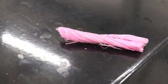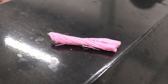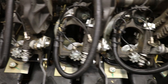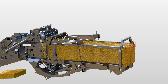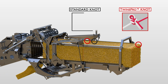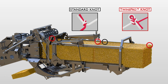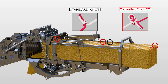The Twine Pro system also eliminates twine off cuts, helping to protect the animals and environment. On 10,000 bales it is estimated to save 3,000 metres of off cuts and associated costs. The new knotter cam gear adds a third billhook rotation for an active release of the loop knot, and the new twine disc releases the pressure on the twine during the second knot formation. The Twine Pro system without doubt reduces twine usage, downtime and wasted bale costs.